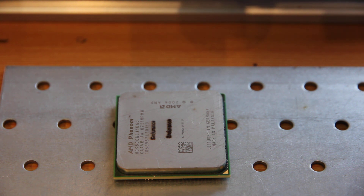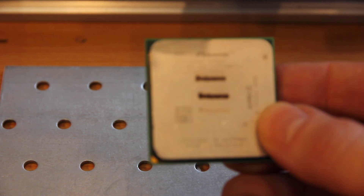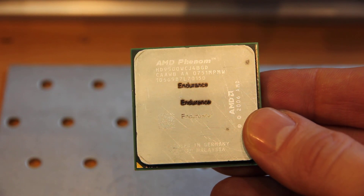So it really depends — your laser engraving depends on the parameters you are using: speed, power, and also how you focused your laser, because here you can see it's going to be thinner and more accurate. I changed three parameters. Let's see the result — I like the third one the most.